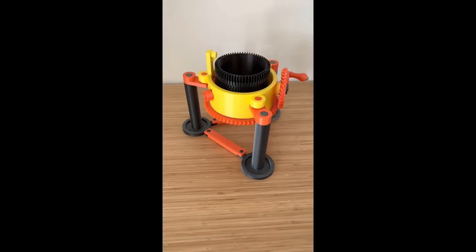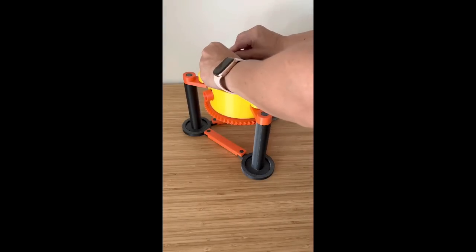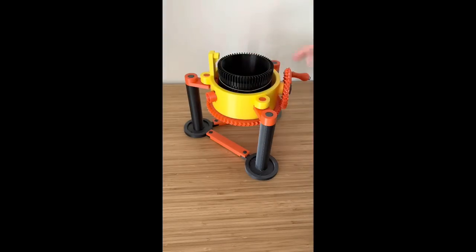Our circular sock machine has been built, and all we need to do is add some needles so that this machine can do its work. So the first thing we're going to do is add our spring or elastic to the machine so that we can insert the needles. This spring or elastic is going to help the needles stay in place as they move up and down in their slots. It sits in this ridge right here, and this one's a little bit loose, but that's okay. It's just there to help make sure that the needles stay where we want them.